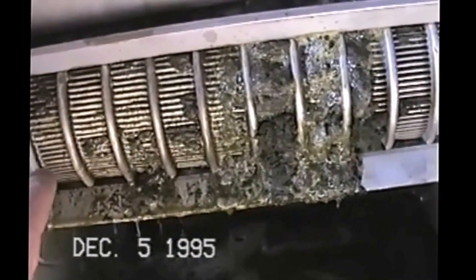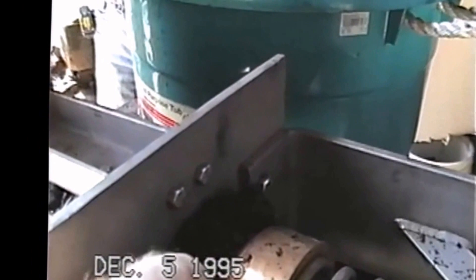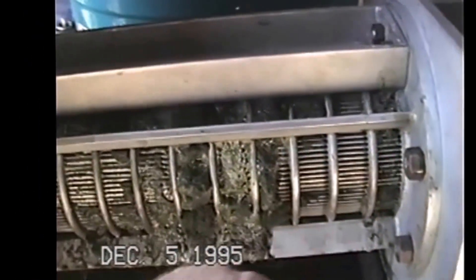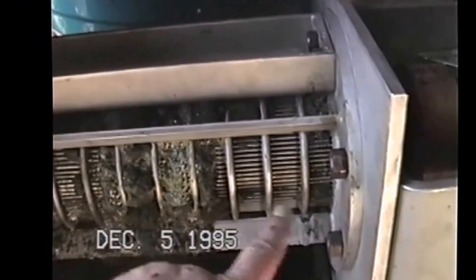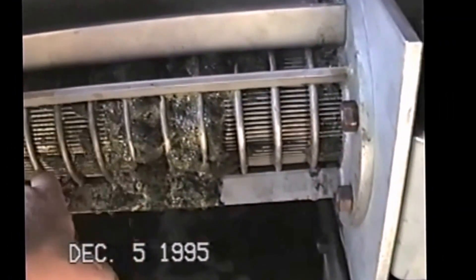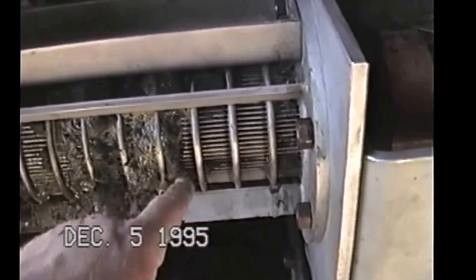You can see that just about all the moisture is out of it by the time it gets down to this point in the press, and the press cake that's coming out is extremely dry. If we were to actually build a press for this, it could run a little bit faster and add more capacity — we'd probably open up the press by cutting back on the resistor teeth and the flights down in this section, and what you'd see is more dewatering all the way across the length of the press rather than all the dewatering in this section and then just trying to force this kind of incompressible material through the last portion.